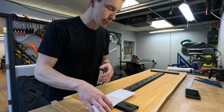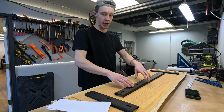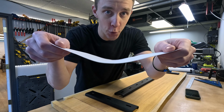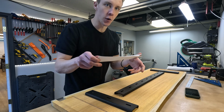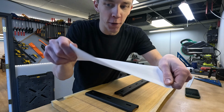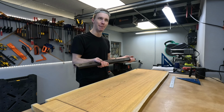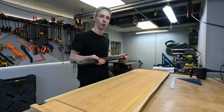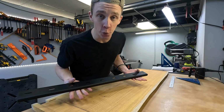You see, what I'm trying to prevent with this centerpiece right here is any warping that would cause the piece to go down. With people sitting on it over time, it would have the tendency to bend and bow downwards like that. The two sides are to prevent warping that would be like one side being pulled up and the other side being pulled down, so that it doesn't go like this, pretty much. So this is just essentially a massive clamp that you're permanently installing on the piece so that it doesn't move around and warp in ways that you wouldn't want it to warp.